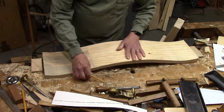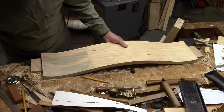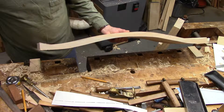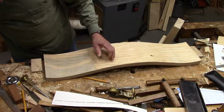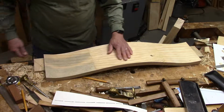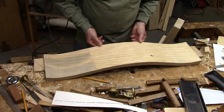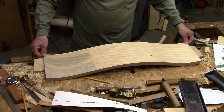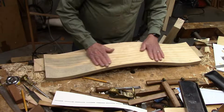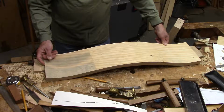Here is the largest drawer down at the very bottom of the chest, and I've started to do it. It's bandsawed, as you can see here, and I've cross-cut it. It does fit in the drawer opening. I've tested that. And there will be a cock bead, 1/8 inch surrounding, 1/8 inch ebony. After I put the veneer on, then there's the cock bead put on here, and then I've got to create the dovetail joints for the side pieces, and so on.